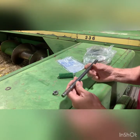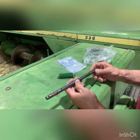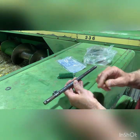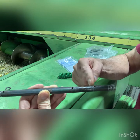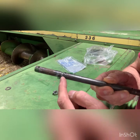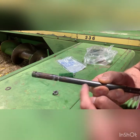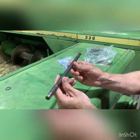It's a really pretty simple fix, and I hope what I've learned here I can pass on to help you out. This is the shaft and it sits in the forward section right behind where your feeder forks go in. There's a bracket it slides into on one side and on the other, and your hay dog will be sitting right here. You can see where the wear is — this is from years and years of banging around in there, because it's just metal against metal, not on a bearing, and this metal is really soft.